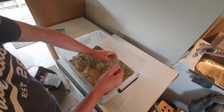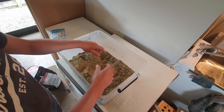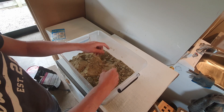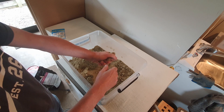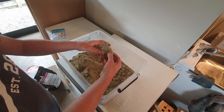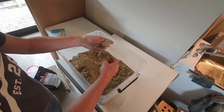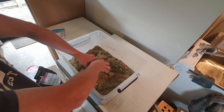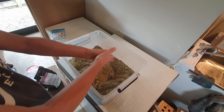When I first started the sand was too dry, so I had to add a bit more water, and it didn't clump very well so I put in more cat litter. I've now got about ten percent cat litter in the ratio to the sand, and it's holding together a lot better and breaks really cleanly. So the sand has come out really well.